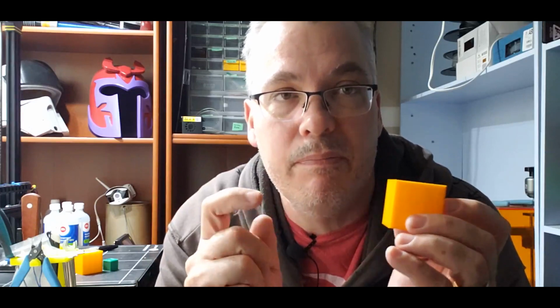Now, if I wanted the cube to be slightly bigger, I would think the steps would be bigger. Because with my Chiron, that's exactly what happened. I went from my smaller steps. Where are they here? I wrote all this down so you can see. Now I can't find them. Oh, there we go. Okay. So yeah, my Chiron was 80, 100, and 400 for the X, the Y, and the Z. And it ended up being something like 80.2, 100.4, and 400.5 or something like that.